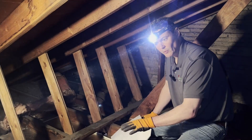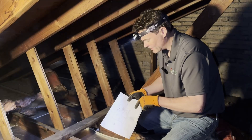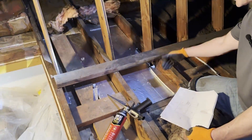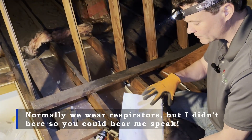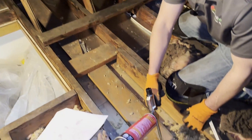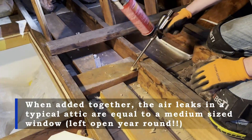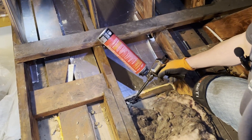What we're doing now is air sealing the attic floor. Before we come up into the attic, the first thing we do is draw a map from below of all the air leaks, so we know we're looking for top plates, wire holes that come up from switches. There's also a void here for a stairwell that goes down to the basement — we put foam board over top of that and seal around it with foam. Once we have the map created, we come up into the attic space and seal all of these things: wire holes, both sides of the top plate. We pull the insulation back as needed and hit all these leak points.